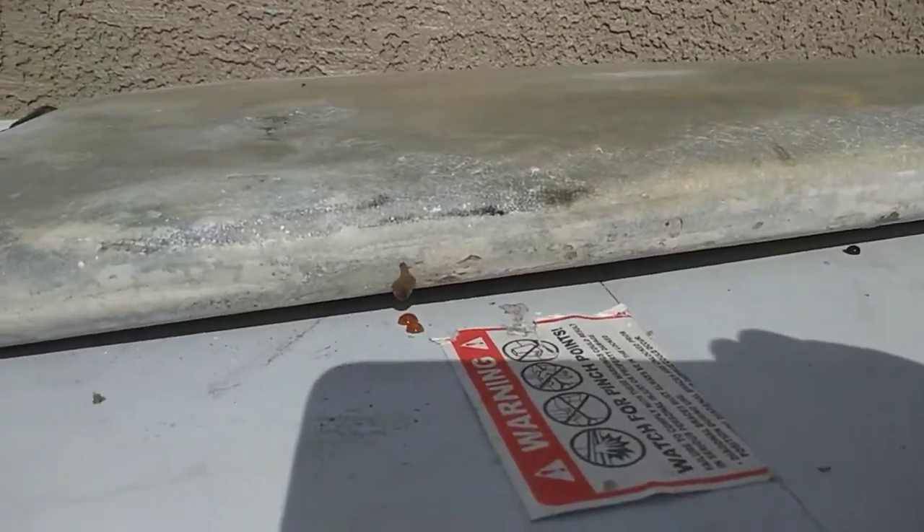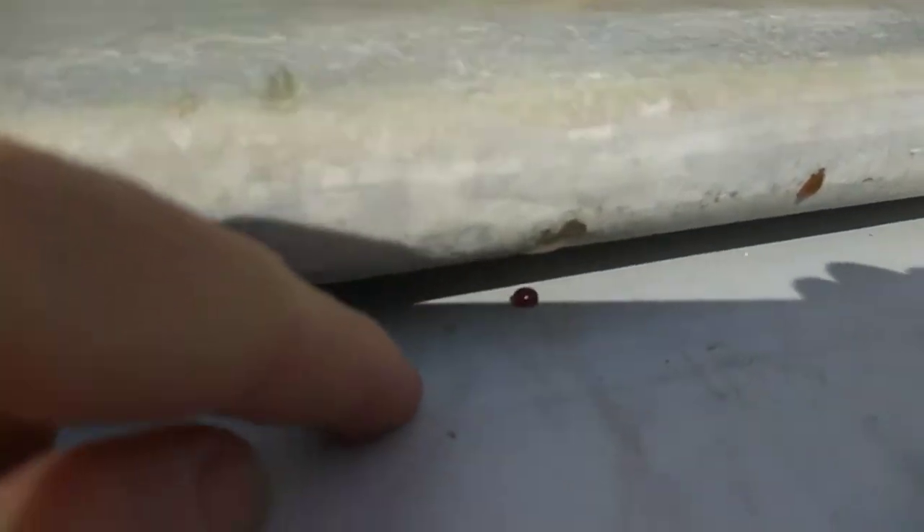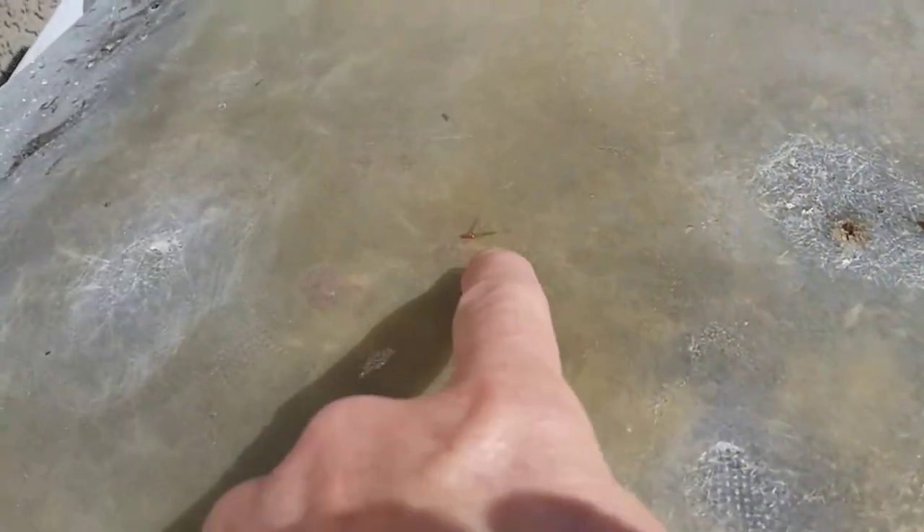Alright, I've been at the boat yard for a few days, and now I'm going to continue on this rudder. For my birthday, I bought myself a Dremel tool, which I've always wanted. And I'm going to Dremel these out, but I'm thinking that I'm going to have to be attacking more places on this rudder than I thought. It's been sitting out here kind of drying out, and I'm noticing these drops of dirty water coming out of areas that don't even look like they have cracks, and there's some seeping here as well.